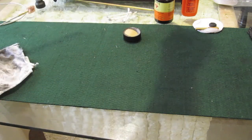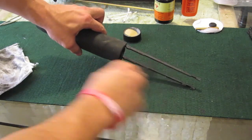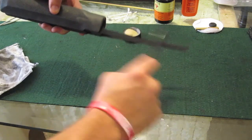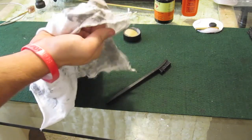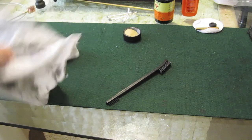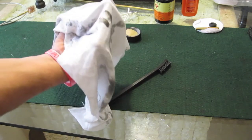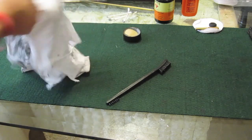And your forend, the rods are always coming in contact with gunpowder because they're interacting with the cartridge stop and interrupter on a constant basis. I mean, look at all that crap I just pulled off. Let's see if you can see a clean side. Alright, clean side. Not so clean side. So, yeah, these things do need a cleaning.